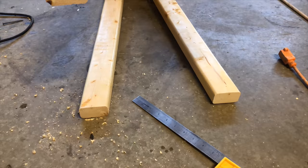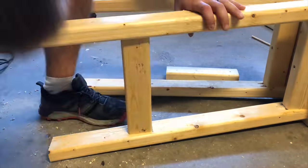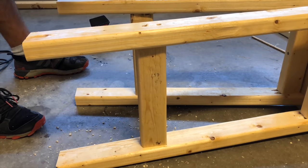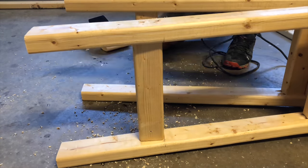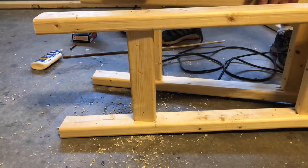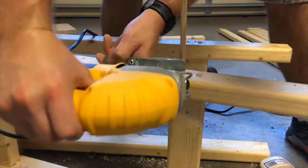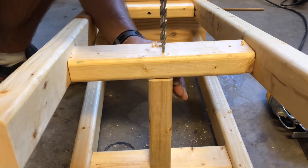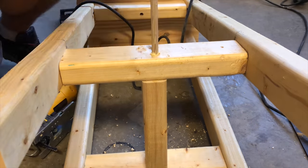Now I'm going to measure ten inches up from the bottom of the chair. These marks will be parallel with the floor. I'm attaching my other ten and a half inch 2x3s just flushed with the bottom of that ten inch line, joining these to the legs the same exact way as the other ones, except I'm using two holes on each side. Let's take a quick measurement between the bracing on these legs. Mine just happens to be exactly eight inches. So let's take one more 2x3, cut it to that length, and center it between these two braces. I'm using two screws to do this and the same method I've been using throughout this video.